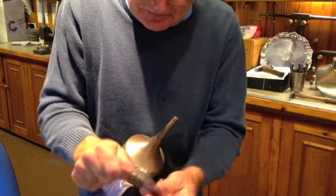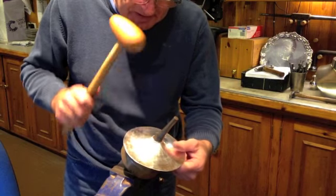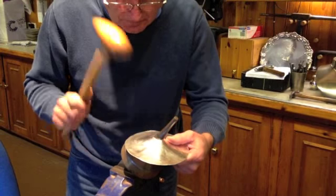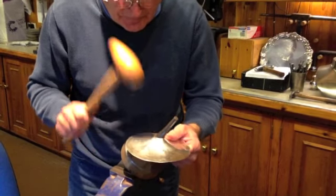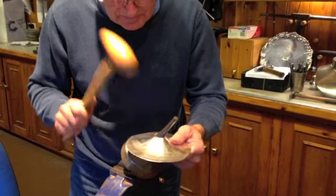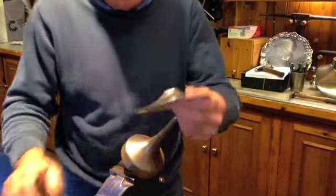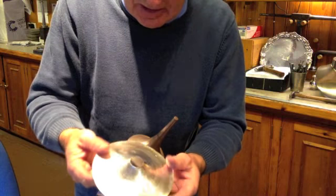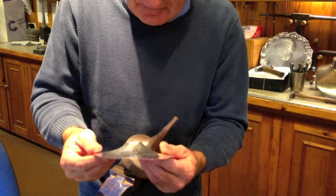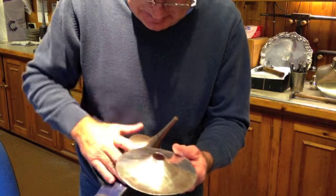So now this is quite soft. I can put it onto this little stake here and go with this mallet and then start to get the item completely true. You can now see this section here is getting together right. So I'll carry all the way around till it's completely accurate, and then after that I'll do the same with the other section. That's finished just blocking with it, and then I'll start on this stake here.